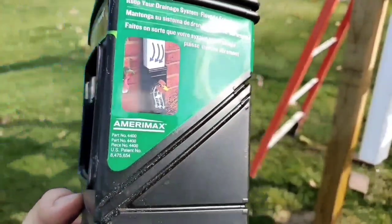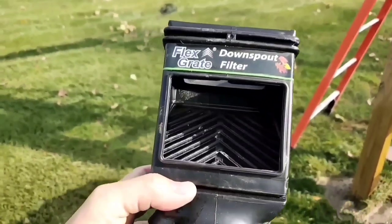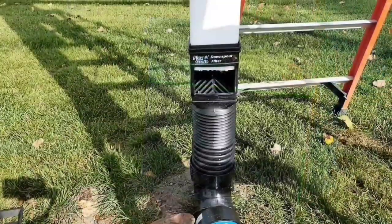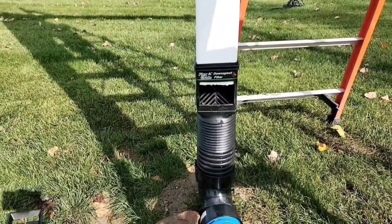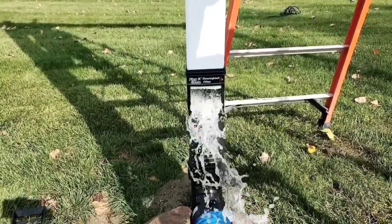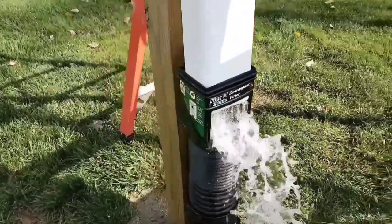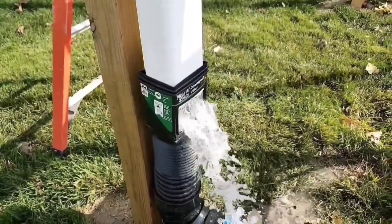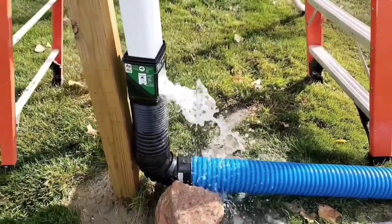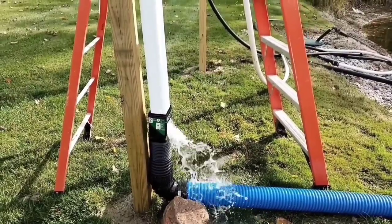In my 35 years as a contractor, I'm going to give you my honest opinion. This is the worst leaf filter on the market. It's supposed to filter out the leaves so they don't go underground — supposed to hit that grate, the leaves fall out on the ground, and the water goes through. In the ad, they'll have a trickle of water coming down the downspout and show the trickle hitting the grate. This performs so bad. This is such a liability to the homeowners, and this is what's in Home Depot. It's cheap, it's made in China, and the sun eventually weakens the corrugated portion of it and it just splits.